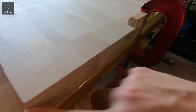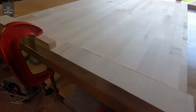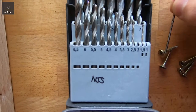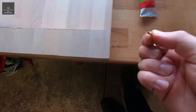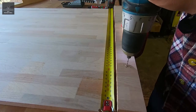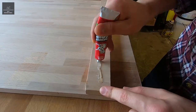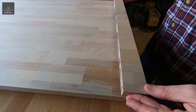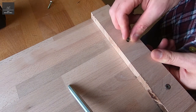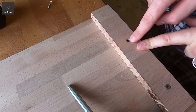I've just used another piece of timber for clamping purposes. We're going to pre-drill these holes with a 2mm drill bit and also set an end stop so we don't drill through both pieces of timber. Unfortunately I actually snapped a screw — you can see the head, it just kept spinning in the hole. So I'll drill a hole next to it, put a second screw there, and then just putty that hole up.